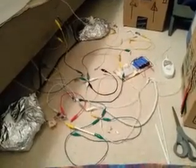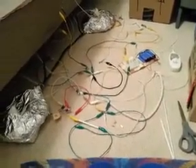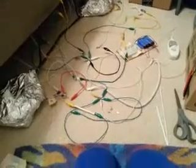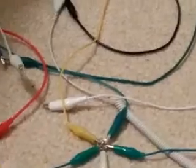I realized, though, I have 2 hubs. When I combine various branches, sometimes it's very similar. It's just 2 wires or a wire and a diode. But sometimes it's a lot of wires, and I'm noticing there's 2 hubs. So here's one hub here, and here's another hub over here. And it turns out that they're on either side of the leftmost toroid in this diagram. So here's a hub going to earth ground. That's on the bottom, big A. And then the other hub is down here.